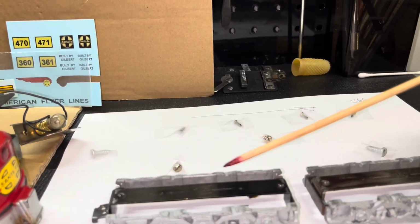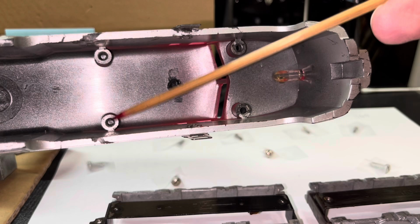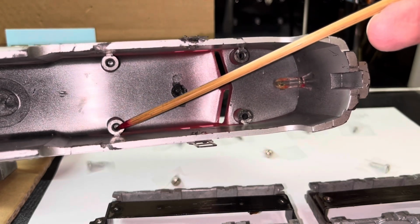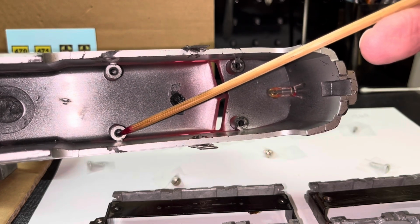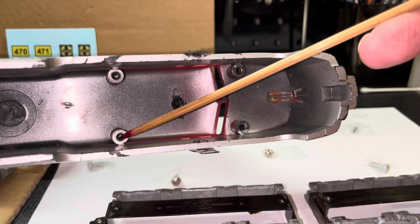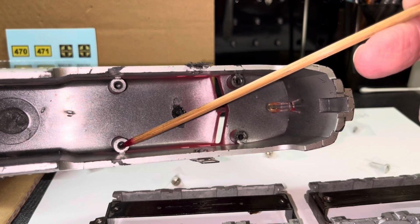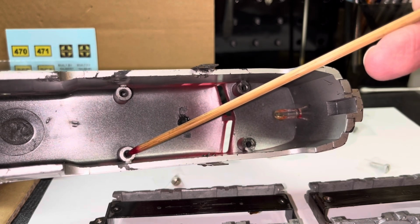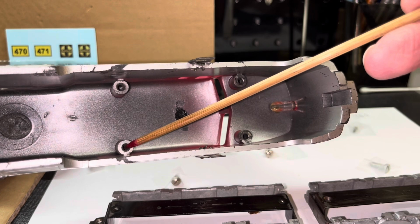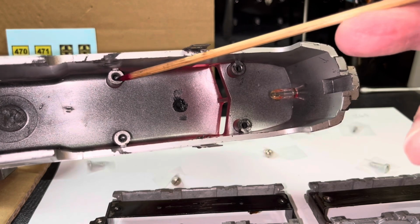firmly, couple of things, and I'm sure that there's other ways of doing it. Many of you probably have figured those out, is that sometimes I will simply pack these screw seating areas where the screws should attach with standard DuPont airplane modeler's glue, and pack it in and let that cure for a while. Then go back and drill it out with a tiny drill such that I can get the screw restarted. Now the glue doesn't do any damage. It actually can be picked out later, but it does provide a real simple way to provide a smaller hole to seat the screws in.